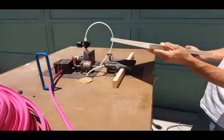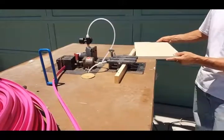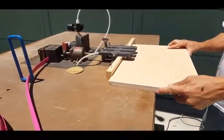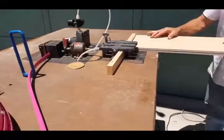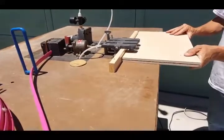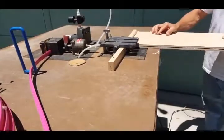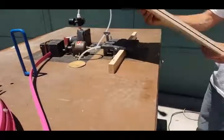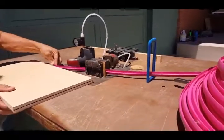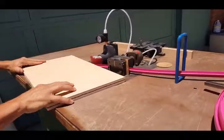This is just a piece of three-quarter inch thermo fuse laminate. We're going to cut the kerf first, and then we'll go to the other side and show you how to apply the T-molding. You start by simply inserting the T-molding into your kerf right here, and then you begin to hammer it in.